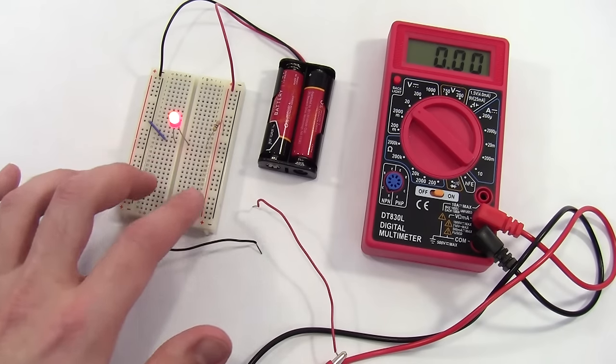I started at the lower end of the range with what should be a 47-ohm resistor, and I'm getting about 46.8 to 46.9 ohms — pretty close. As I go up in range, I lose accuracy because I lose the decimal place, so for a small resistor like this I want to be at the 200-ohm range. For a bigger resistor — this one is supposed to be about 10 kilo-ohms — I get the '1' outside-of-range indicator at 200 ohms, and as I step up, I get about 10.3 kilo-ohms, not exactly 10 kilo-ohms, demonstrating that error percentage.